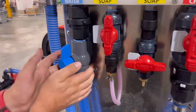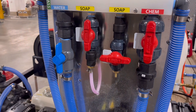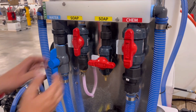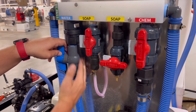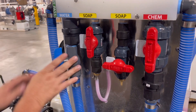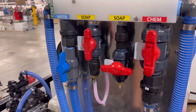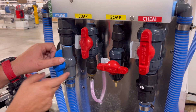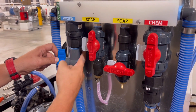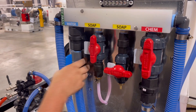Another thing — come around here — you can see this is moving and it shouldn't be moving. Nick is holding the camera and we build these systems every day. We've done over 200 just this year and we're only halfway through the year. This does not have any mounting points on the back of this ball valve — there are no bolt holes. So this has vibrated over time — not much time — it's vibrated and messed it up just within the first couple of weeks of usage. We're going cheap here, screwing up our hydraulic flow, and we're also lacking a mounting point to lock this down, which has caused it to be able to rock.